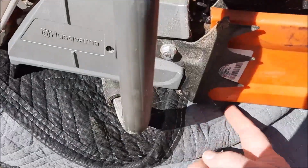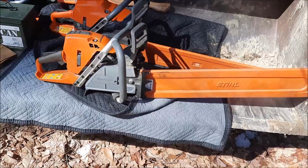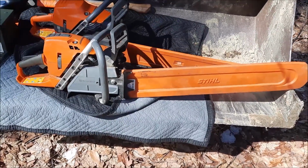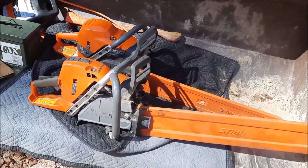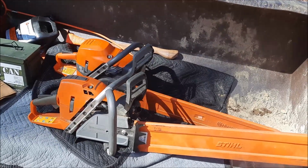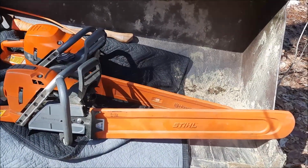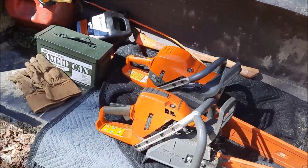And so I cut this back about a half inch, and you would be surprised. I guess you wouldn't if you laid it out on a piece of paper and figured out the distance, basically the lever arm about the sprocket. You'd see that it actually makes quite a difference. But to look at it, it still looks like a big old Western style spike. And my gamble is, by doing this, I can still hold the wood that I'm working on away from my saw and muffler, but I haven't provided a geometry situation where that bucking spike provides too much leverage and stalls that chain. But before I get too far into this, I need to load these things up.